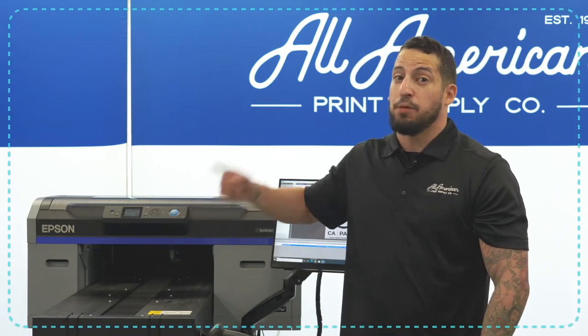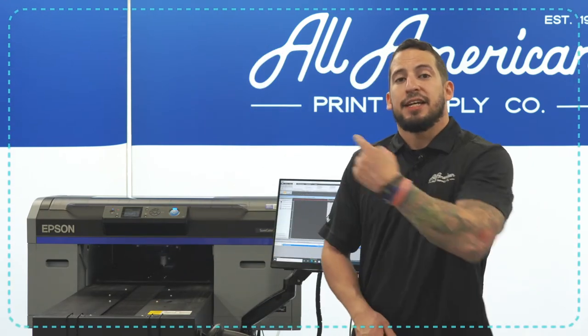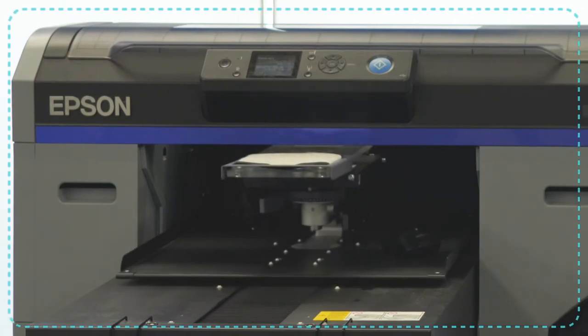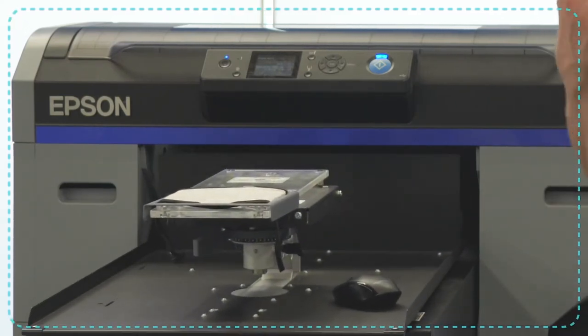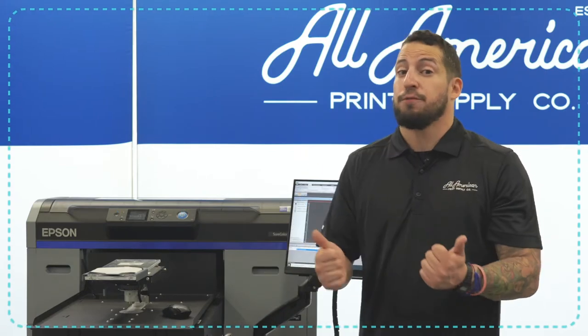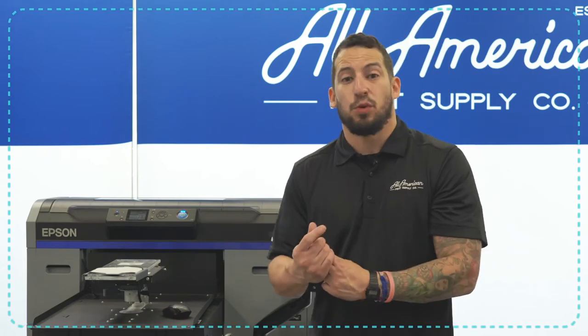Now, if you hear that beeping, you probably know that sound. That's gonna be a platen height error. What's happening is, inside of the Epson Direct to Garment printer, it has a safety mechanism to prevent any kind of incidental contact with the printhead, also known as head strikes. This is kind of a smart feature. The machines are getting very intelligent. They look after themselves, they communicate what they need.